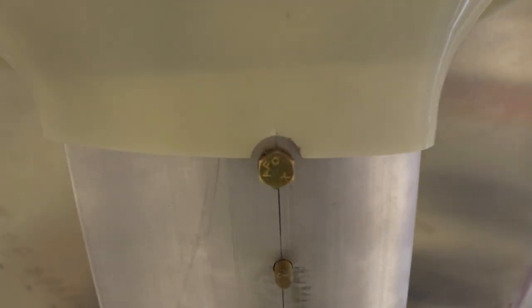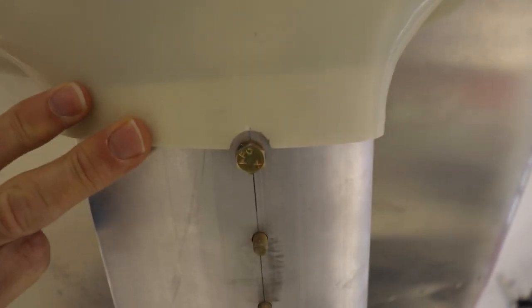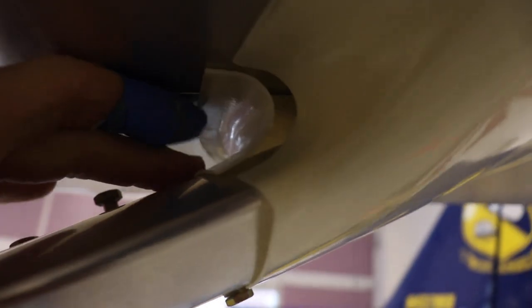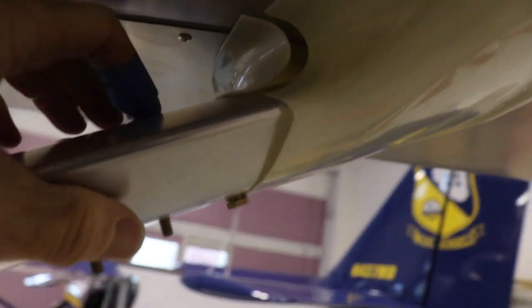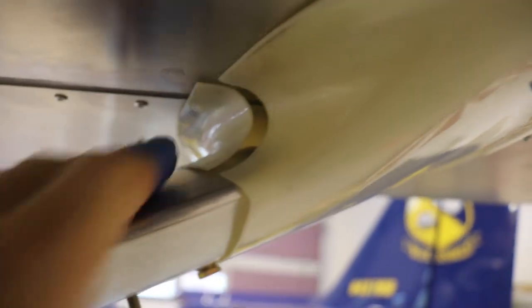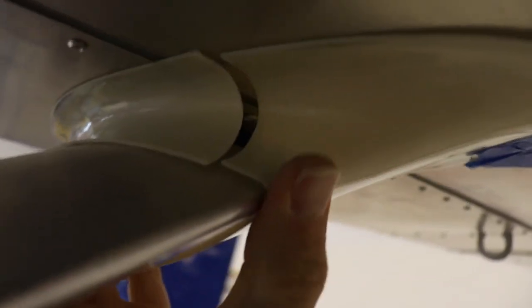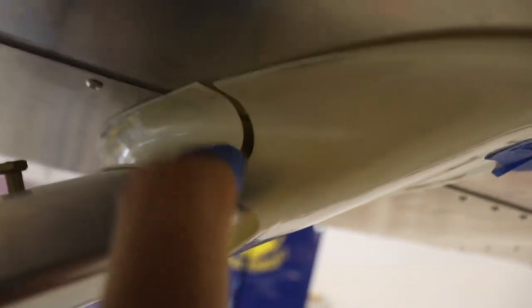Here's what it looks like. I put a little bolt with a washer in here just to show you what it would look like - obviously the nuts will be on the bottom, so this would actually be a nut. That's how it looks. What I'll do is take that bolt out, put a drill bit up through here all the way up through the top, and that will mark the location up there since I can't get in with the wing. Then I'll cut a little half circle out of there too. This gap almost completely disappears - these two match up just perfectly. It looks great - really happy with these.